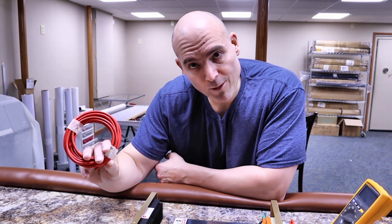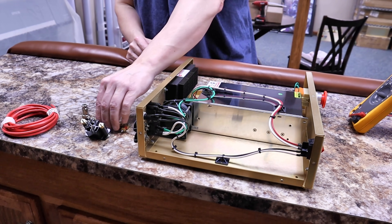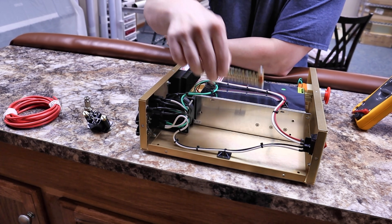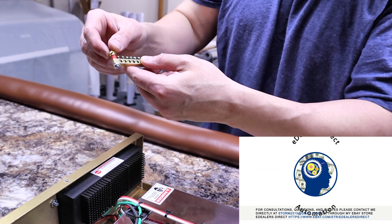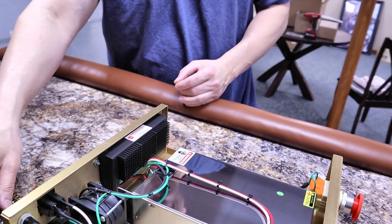All the components included here — this is 22-gauge double-shielded torch cable. The relay right here is all set with tool-less mounts. Everything here is set exactly as I would do it myself. It's not a lot of work in the sense that if you understand what you're doing, it's not a big deal. It is time, and it will alleviate cost on the system. What you're looking at here will provide a guaranteed grounded system. Once installed and touching this enclosure, we now have a ground that will instigate grounding on whatever he decides to install. He has all his positions, and I'm going to include ring terminals that will mount underneath these spacers on our screws. You can see our spacers underneath, and we have an excess length of screw — you have to consider the thickness of the box. That's engineering in a nutshell — every detail, because that's what you're paying me for.